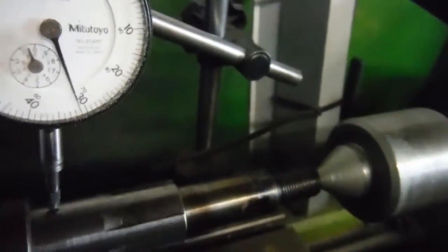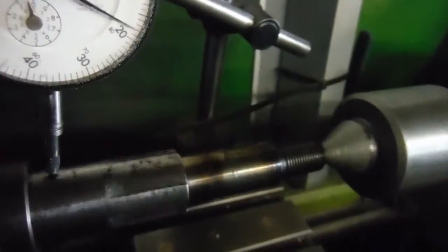It's going to destroy the main bearings in no time. We've still got the inner race of one of the drive side main bearings — the roller bearings — in situ, and if I turn it you can actually see the worn area that's become dull rather than shiny. There must be an immense strain on those main bearings. The end of the main shaft has also got so hot it's become discolored.